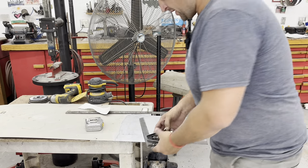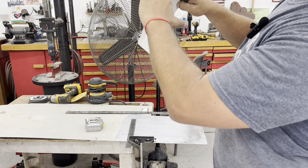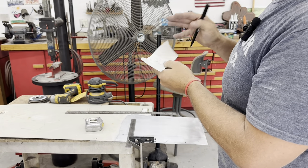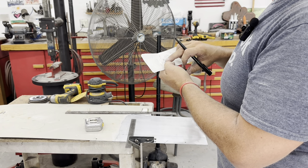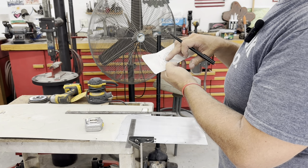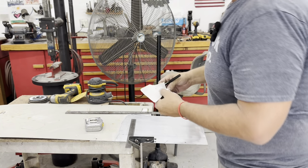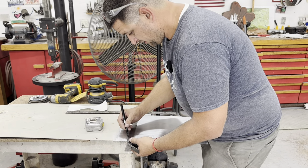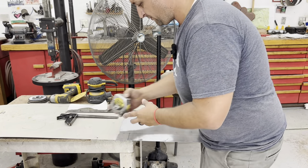I've got it drawn out with the baseline. If I cut the ends down with that taper, I'll barely have enough of a gap on the end at the cut line. I'm just going to make these end caps separate. I'll take the base on the side, fold that over the edge, have the top, and just weld one seam there and one seam on the other side. The back side is going to be open, which is why I wanted that taper for a little strength. As I make my way forward, I'll show you what I'm thinking so you can sort of follow along.